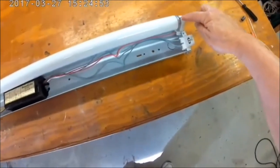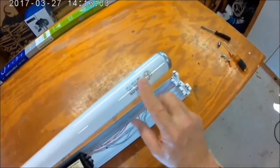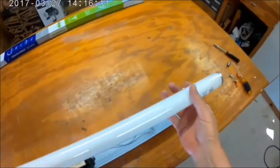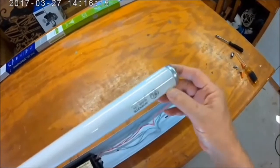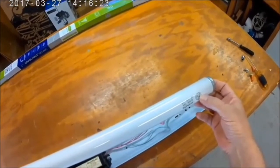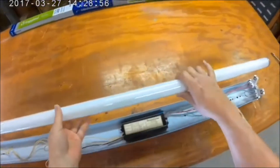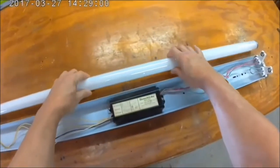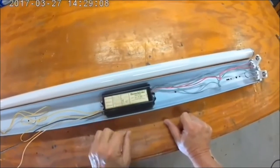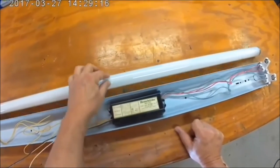And that, in turn, heats up the little electrodes in here — little tungsten electrodes. There's no wire, no element going all the way across. When this tungsten electrode heats up, it gives off electrons that vaporize the argon gas inside. That arc also needs a higher voltage kick, which is produced by the magnetic ballast — an inductive kick causing a higher voltage, around 215 volts, to temporarily start that plasma arc.